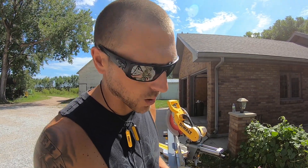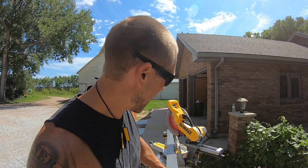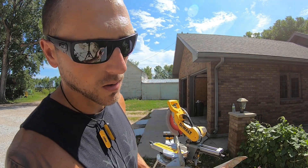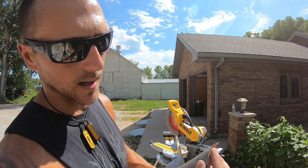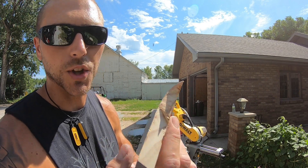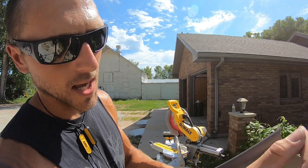Have a vacuum set up, plenty of air, and just try to avoid MDF altogether. So there you go — simple profile coped. I'll go install it. I leave a little bit of meat at the top and notch the receiving end, and that works well for me. Thanks for watching — hope some of that helped somebody. Meyer Construction — please hit like, hit subscribe, and keep hammering.